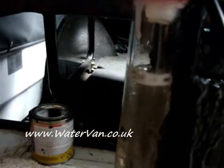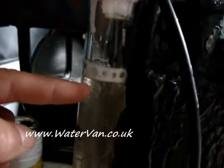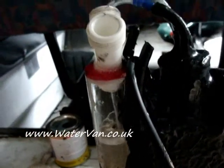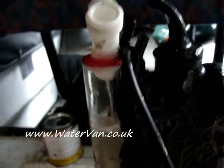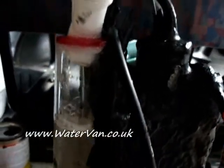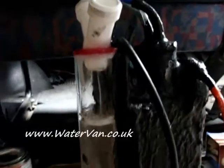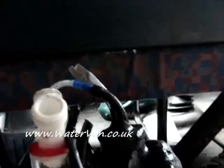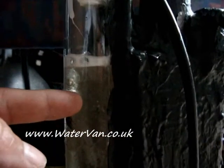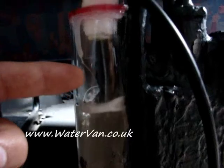Now that there's some pressure within the whole unit, the level of water has risen above the bottom level of the tube. This has got 350 millilitres of distilled water in there and 10 grams KOH, and it's running nine amps at 14.1 volts at the moment. But it's working like a dry cell would, and the fluid's been pushed up through the pipes, back down into the bubbler or fluid separator, and it's just the gas escaping out the top.